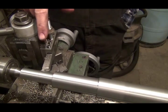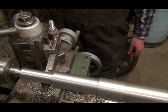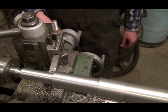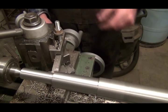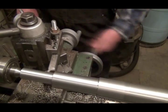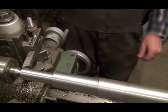You want to be careful with those little coils — sometimes they'll run clear to the floor, and you do not want one of those to grab your pants or your hand because it will cut you deep and they are sharp. I don't like it when they coil like that; I'd rather have these little chips. I do a lot of cleaning — I don't like walking on chips and I don't like having chips all over my lathe, so let me clean it up.